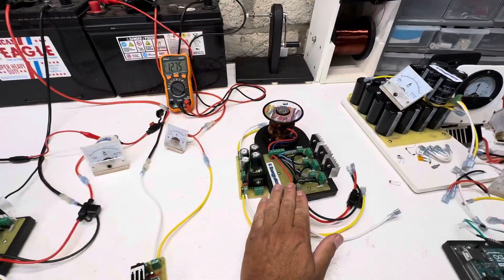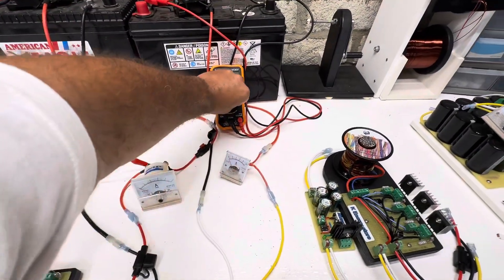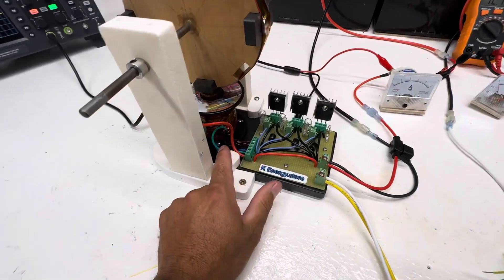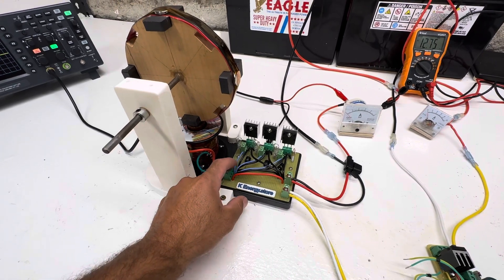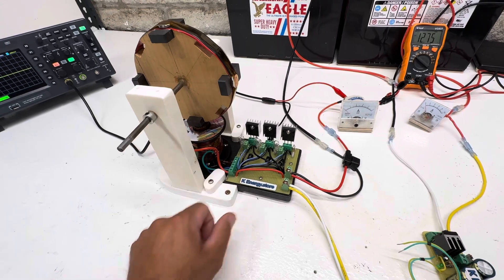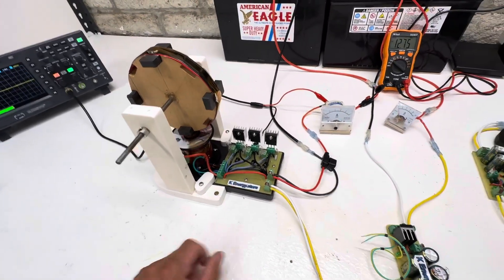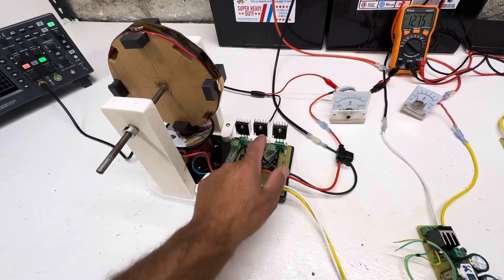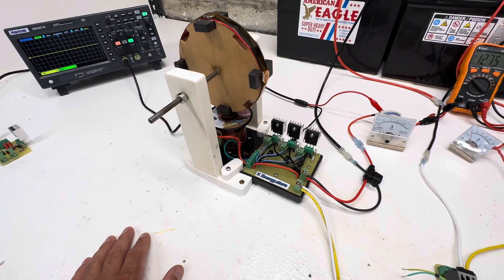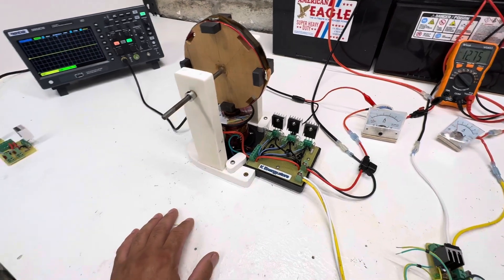This is the oscillator cell on my website. It has two functions — it's solid state. All you have to do is switch the purple and black wire and the purple and green wire into this configuration, and then it becomes just a regular Bedini circuit. Instead of 2k resistors, we have light bulbs in here that are really low resistance to get the motor started easily. You could always put a pot where the green wire comes in to adjust it down once it gets started.